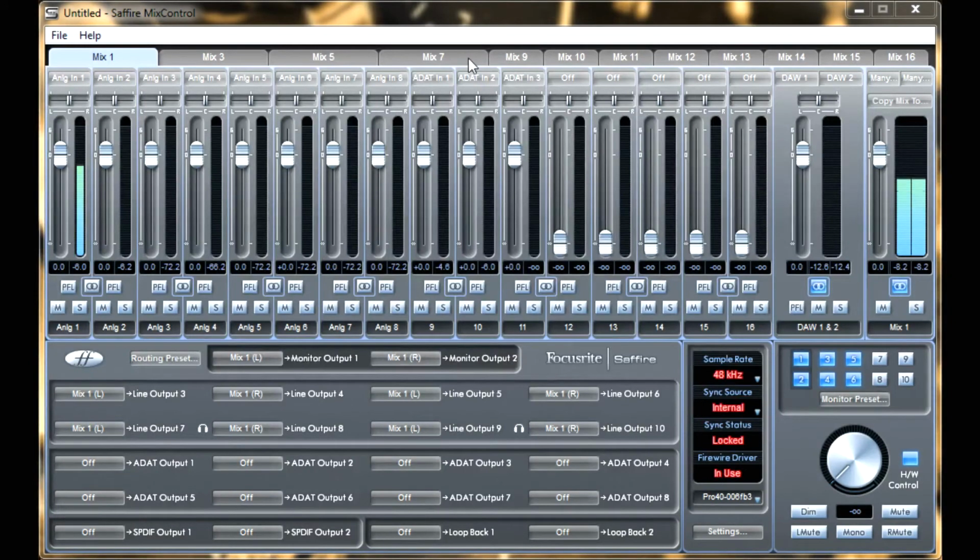Just make sure when you're plugging these together with the FIREWIRE that you have these things disconnected. When you connect FIREWIRE cables, you do not want to have anything powered on. Disconnecting them or plugging them in, it will ruin your gear at some point. It may not be the first time, but it's definitely going to be at some point. It will ruin the gear.